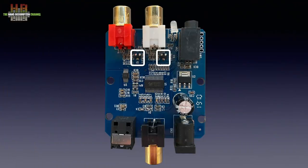Within a few days Pieter discovered a serious problem in the design. Both the left and right analogue output circuits contain a FET — a field effect transistor — that functions as a mute switch when an unstable situation or lack of digital signal occurs. Every DAC has a mute provision to kill the output when there might be a loud click or pop, since that might damage the loudspeakers. But here, according to Pieter, a FET is used that is designed for a voltage line of 5 volts, while the voltage line after the voltage regulation is 3.3 volts.